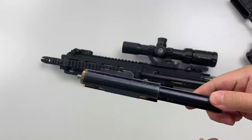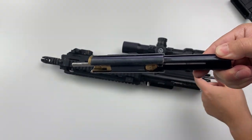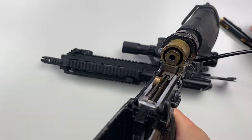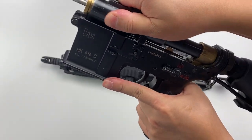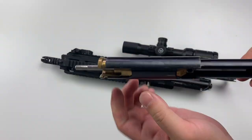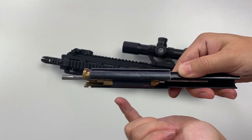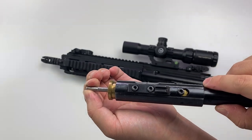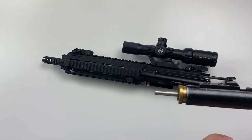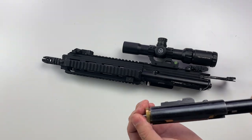What happens is the air goes into here and has no place to go. This is normally held in position by a spring. This is a very interesting buffer situation — these two brass rings are fixed, but the buffer does move. The buffer is in the middle of the space and is actually still used. Right now this is pushed forwards with the bolt all the way forward. The air will go in and the bolt carrier immediately starts going back. You can find an animated image — just Google 'Escort HPA system' and you'll find how it works.